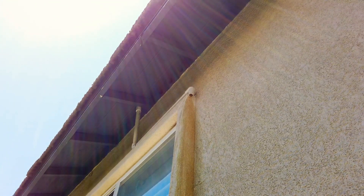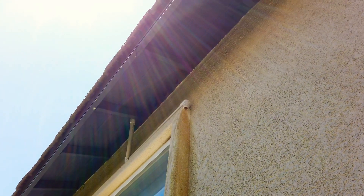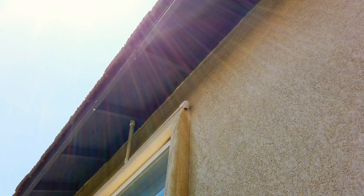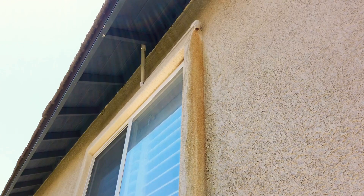Over here — watch this. I've seen a lot of houses like this. It's all water damage here and you can follow it all the way up, and that's what's causing the damage. That comes from the AC — they installed a thing and didn't point it the correct way for the extra condensation to drip out, so it caused a lot of damage here. Hopefully with the Cool Walls coating it's going to protect it and it'll never damage again.